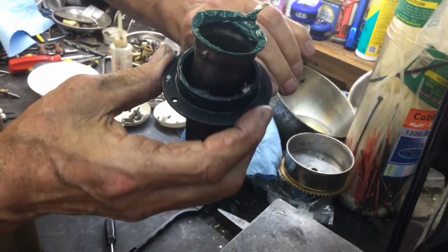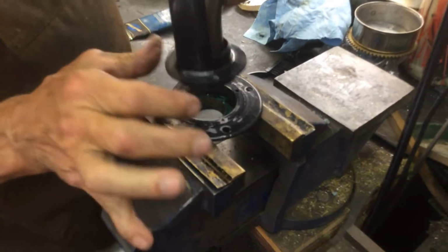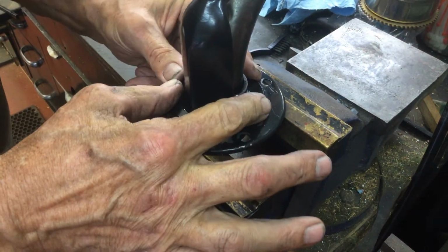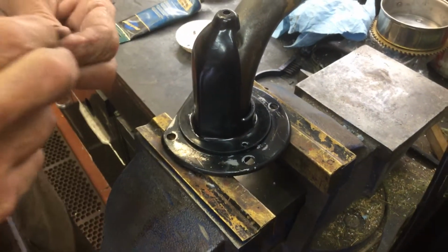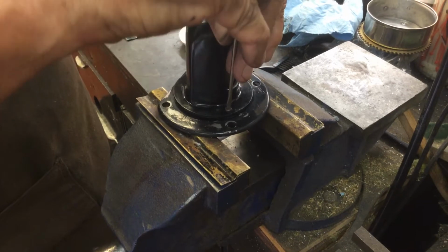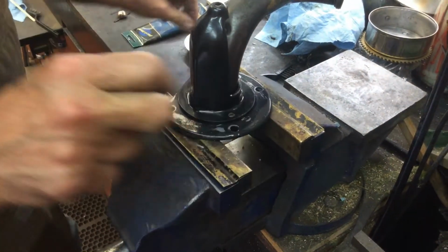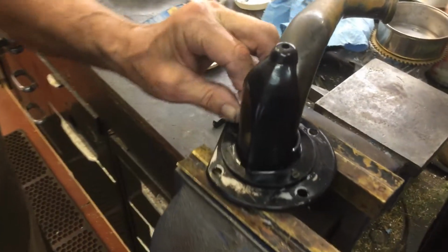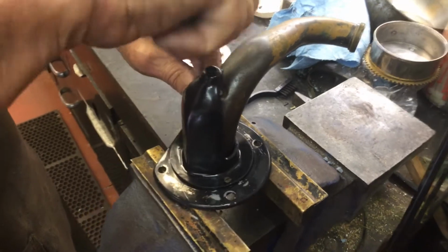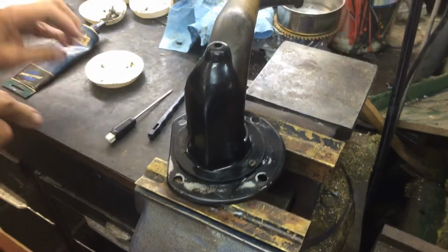And remember we talked about the limit pin. So the tone arm comes in from the bottom like this. You get it where it goes for the limit pin. You got a screw hole here, screw hole here. Set it in like that. And you snug that up. You put the other one in. That's snugged up. My customer didn't want this repainted, that's why it looks like that.